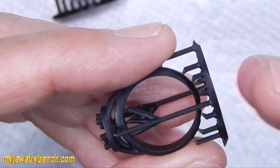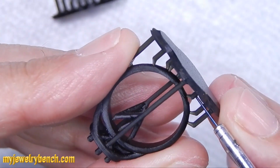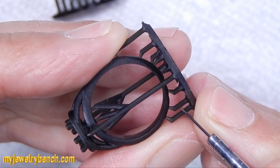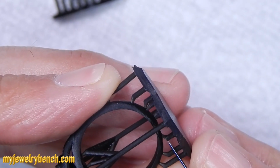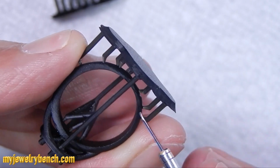The one ring that failed here, I'm going to explain to you why it failed. So looking at the still frame, we can see that one of the supports did not contact the ring. Anywhere else the support contacted the ring and the supports were relatively close, you can see the ring shank actually printed perfect. However, this one location, it just didn't print.